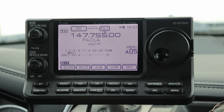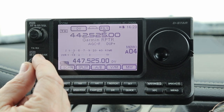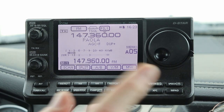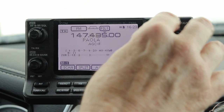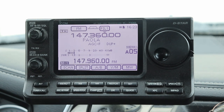Let's say I'm driving around and I reach over for something and bump the dial — I've changed the frequency. I can switch back or go to VFO and back to memory, everything I just showed. But if I bump it off frequency and notice it, and I just go back to 147.36 by tuning — now I'm on 147.36 and it's still set up for the repeater offset at 147.96. WA2IVD testing — and I have not keyed up the repeater, even though I keyed it up just a minute ago without any trouble.